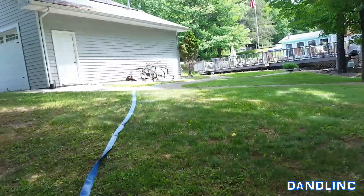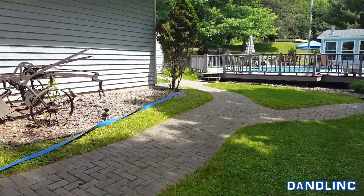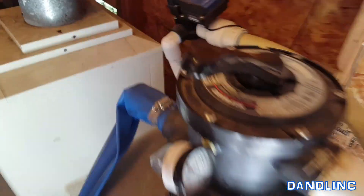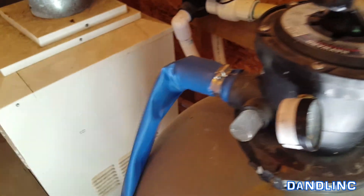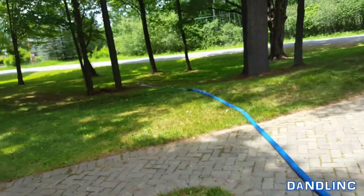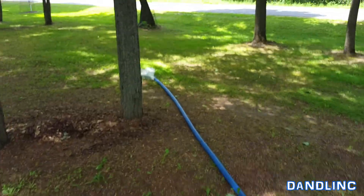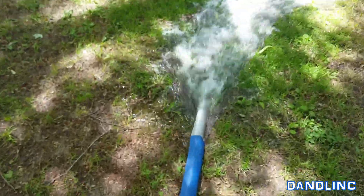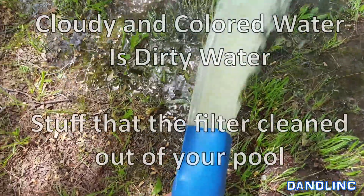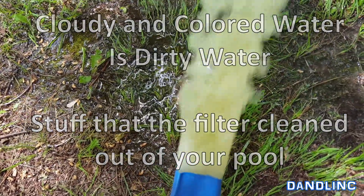The hose is all laid out. I'm going to go back and turn on the power, which will have water go through the filter in reverse to clear it out. Now we're effectively draining water from the pool. There it goes — that's pretty white cloudy water, it's probably going to turn green. There it goes, brownish. You can see how opaque it is — that's all the junk that's in the filter getting spread out across my lawn.